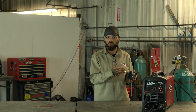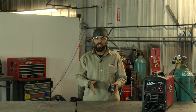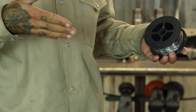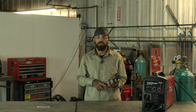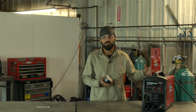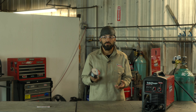You want to run gas when you're in a more controlled environment like a shop. You can have fans, but you can control the direction to make sure your gas is hitting your weld and not being blown away. If your gas isn't hitting your weld, that's when you'll get porosity — holes in your weld. If you're in your garage, make sure wind isn't blowing directly on your welds. If you're outside in your driveway, run flux core.